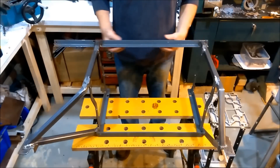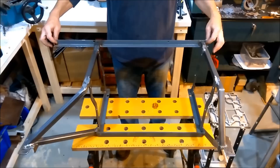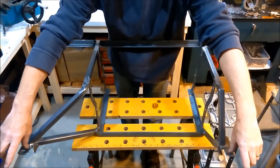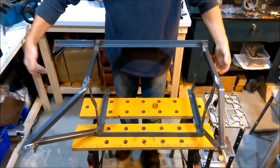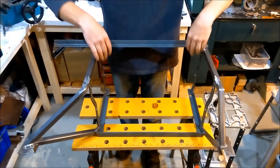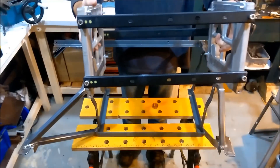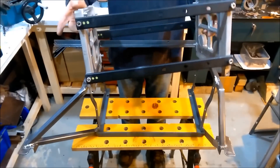What I've done is picked up on the bulkhead of the Smart with this angle iron, and picked up on some existing holes that mount a few components. These aren't really used - these are fixing cable clips I think - but I'm going to put some inserts into the panel and put some screws in there. On the front, I've picked up on the crossmember because there are four holes that mount that, so I'm just using two. It will sit on the main structure of the car. I've created just four vertical strips - I realized I need to make them wider at the top and they can go narrower further down. This unit is the frame I've got for the Nissan Leaf batteries or Fluence batteries. This is the Fluence holder, slightly shortened from a pack of 16.